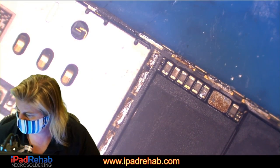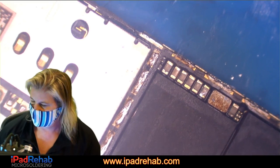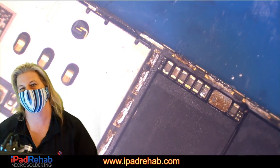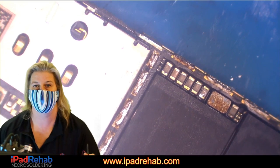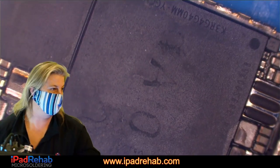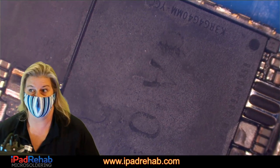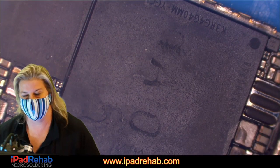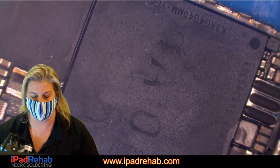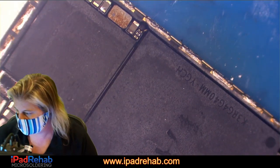Oh no, my comments. Why can't you do a CPU and EEPROM and NAND transplant to the motherboard? You could, but what if it doesn't work? It's a one-shot thing, and it's really sensitive. It is doable, but if it doesn't work, that's the end of the line. If anything happens where you damage something, like I've got two boards sitting right here from Drive Savers that have come to me with the CPU transplanted, I don't even know if that's the CPU for the receiver board or the donor board. It didn't work. And then what do you do? You have nothing left to troubleshoot or try other than it didn't work. So we will do that, but it's not our first tool. It's our last tool. That's just my opinion.